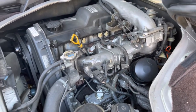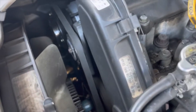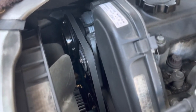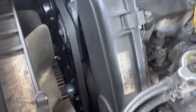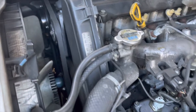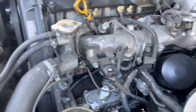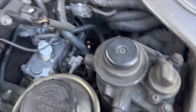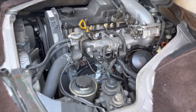That's about all of the general maintenance items in the engine compartment. You might also check your belt condition - you have a belt going to the air conditioner compressor, and there are also a couple other belts for the fan and alternator. These look pretty good but check them to make sure they're not frayed or damaged. You might also check for any coolant leaks around the coolant system, fuel leaks around the injection pump and fuel filter assembly, and coolant leaks around the radiator hoses.